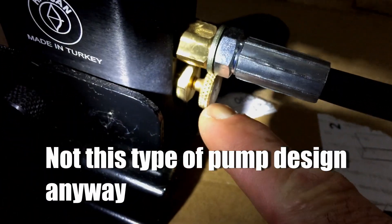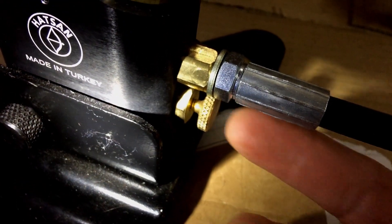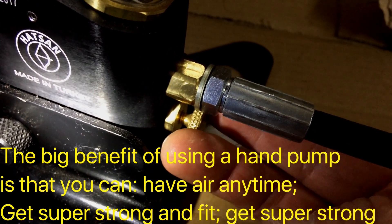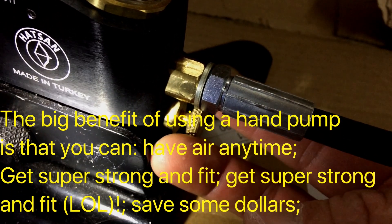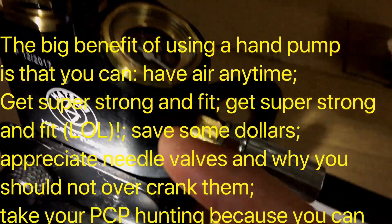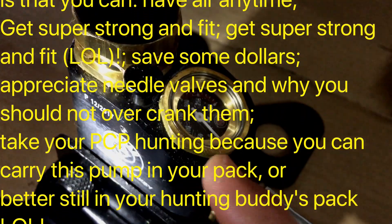Let's have a look here — put the light on there camera assistant please, get that in focus. There it is — that's the bleed valve, used to take the pressure off the line when you're finished. When you tighten it back up, the idea is not to crank the daylights out of it, just tighten it so it's just tight. You'll know if you haven't got it right because the pressure won't increase on the gauge.